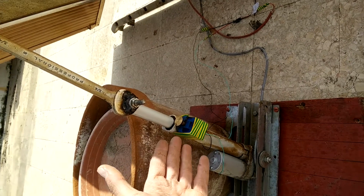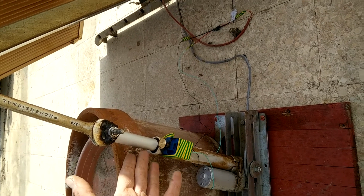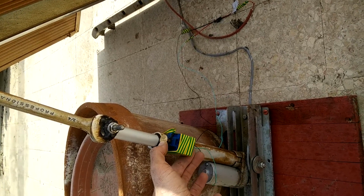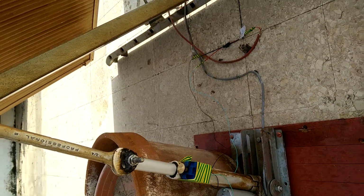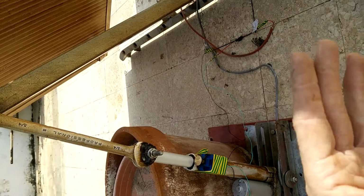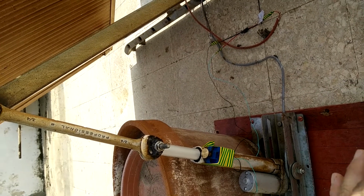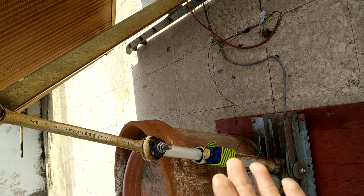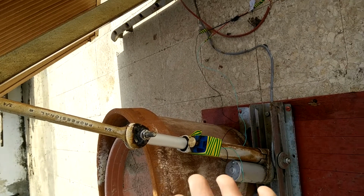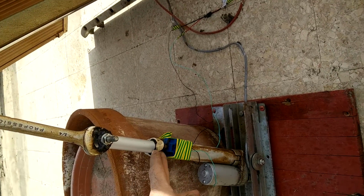stop the motor from going down, because it has around 400 milliseconds to stop, I gave it a little time. It stops, it presses a little, and then it has very little more time to go a little down, but it will not ruin anything. What happens with the time difference is that it told it to stop, but it took 16 times more. Like if it has a range of half a second, 16 times this, it's 8 seconds more, and it continued to go down and down and down, and it broke the switch itself.